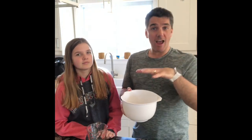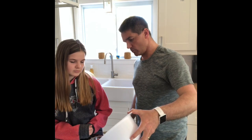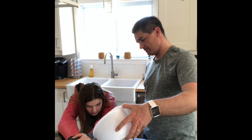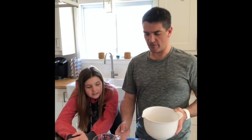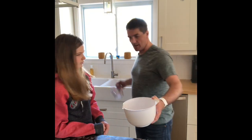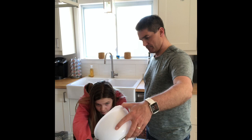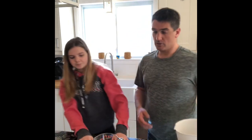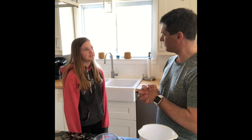Now that we have our five seconds worth of water, we're going to measure it out. We're going to pour this in — Jalen, tell me when we've gotten to a certain volume that's easy to read off in milliliters. 350... 400... 450. So we've got 450 milliliters, and I'll dump that back down. Then we're going to measure the last amount. Exactly 100 milliliters. So we had 450 and then 100 — all together, 550. So we got 550 milliliters in five seconds.